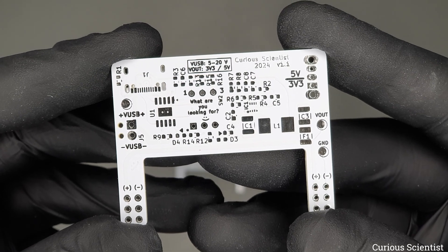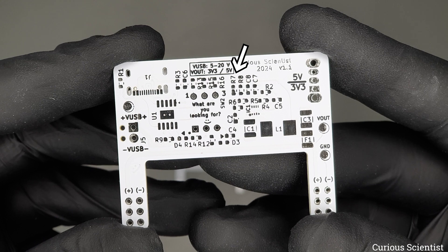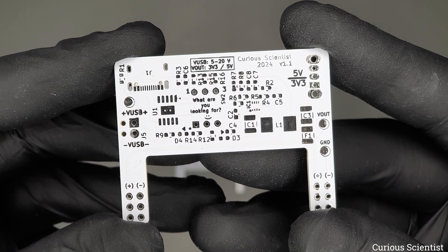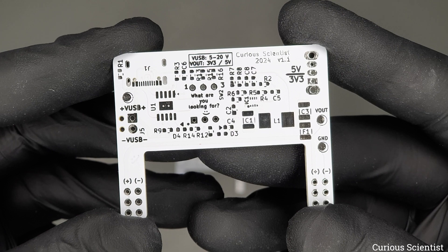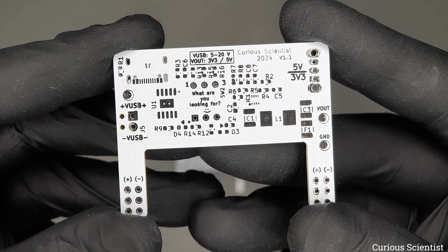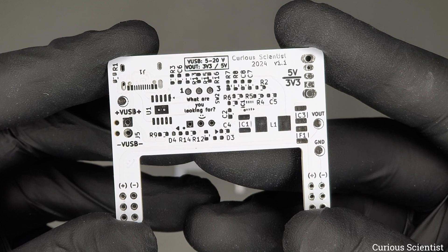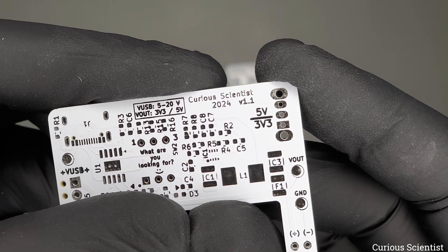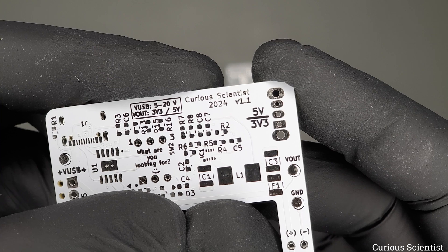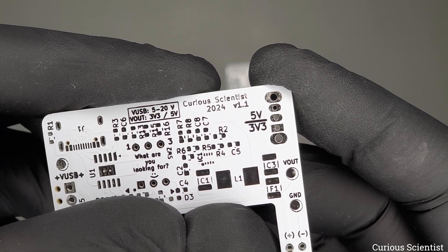Another fix is the rerouting of the R7 and R8 resistors and replacing R8 with another value. This makes sure that even when the switch gets damaged and stays open, or the user does not put the switch to one of its endpoints, the regulator is clamped to one of the desired rail voltages. In this case it is clamped to 5V. Clamping to 3.3V probably would be an even safer option, but I stuck with 5V for now.